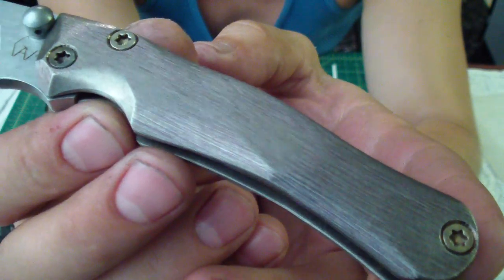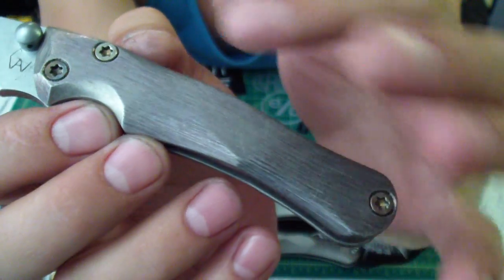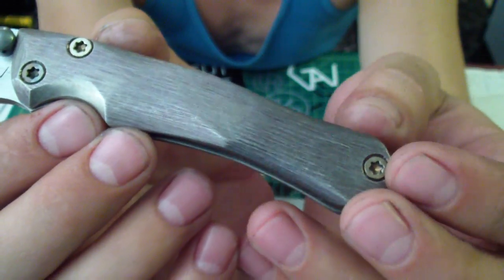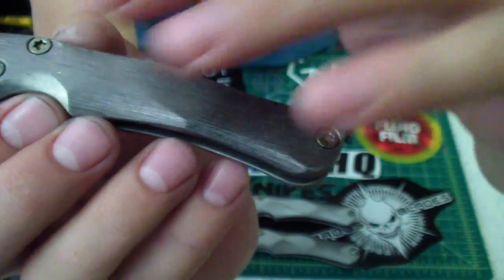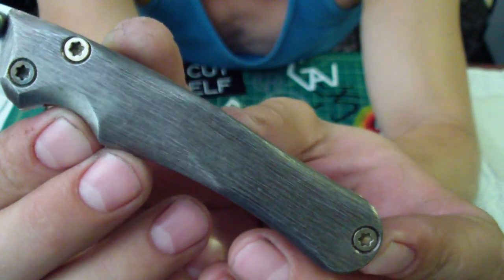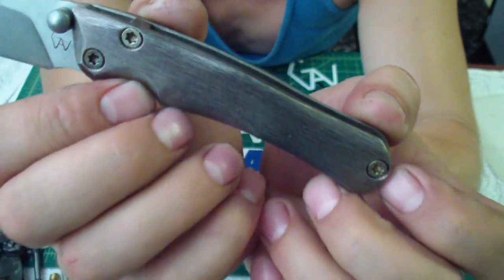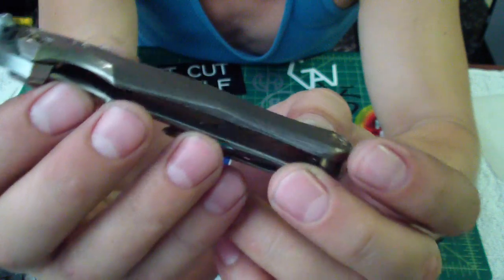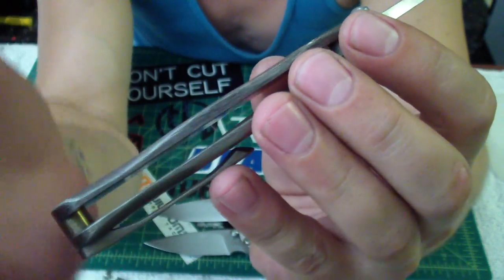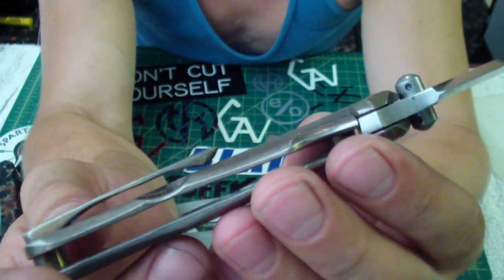I personally love it. I can see that it's probably not everybody's taste, but I like it, and I anodized it with that rough finish, and then I threw it into the stone wash. Stone wash takes off everything except the deep scratches, the coloring, the anodization inside the grind lines. That gives you the illusion, if you are further away, that it looks almost blackish, dark gray, but up close, when you play with it in sunlight or regular light, you see hints of purplish or sometimes even bronzish, and I like it a lot.